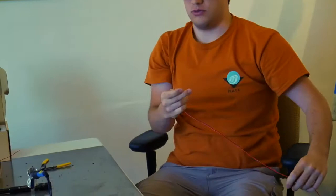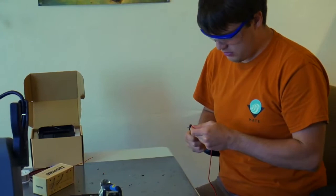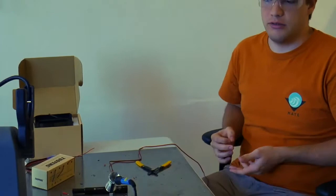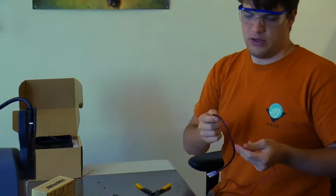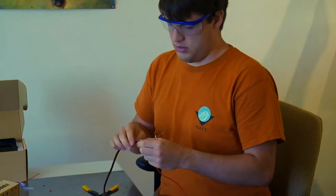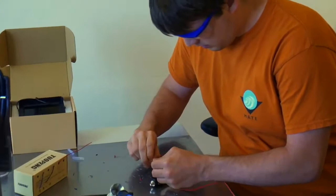To get power to the camera, don't plug it in for now just in case something goes wrong. We've got these wires here — red for positive, black for negative. Strip this off a bit to get some wire to work with, then hook this up to the power. What you're going to want to do is hook it up in the control box past the on-switch, so that when you turn the switch on the camera turns on — you don't want it always on. I'm going to solder the wires straight into the banana connector for demonstration purposes.